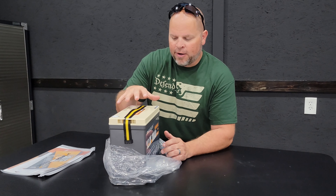The terminal lugs are easy to accidentally toss, but luckily I knew they were there. The first thing I want to do is connect the inverter and the shunt to the battery, then connect the charger and charge it to 100 percent. I'm charging it with a 20 amp charger that's appropriate for these types of batteries, on the correct setting. Now that it's 100 percent charged, I have everything reset and we'll do the capacity test — we want this to go past 100 amp hours.